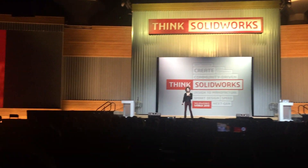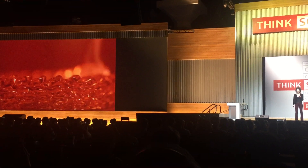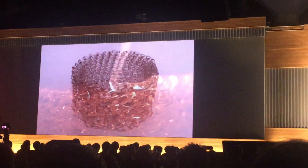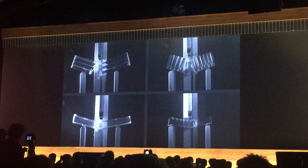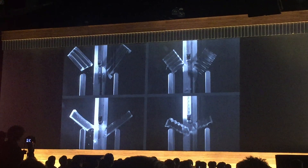This was one of the more interesting moments in the development of the technology, when we realized that if we were to increase the distance between the end effector and the bed of the print, we would get these meandering patterns — much like honey on toast. By controlling the temperature variance and the height, we could also control the shape of these meandering auto-coiled forms.